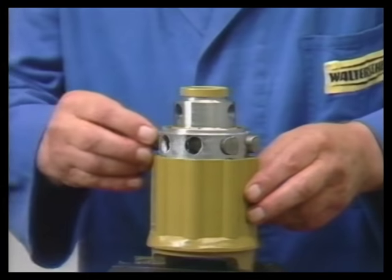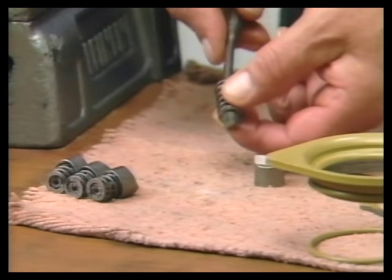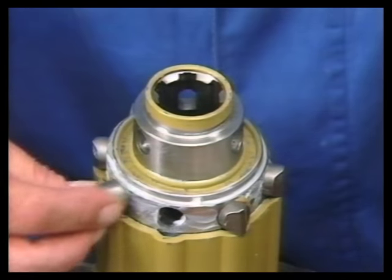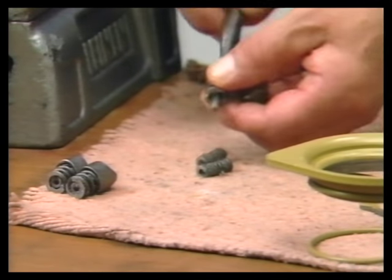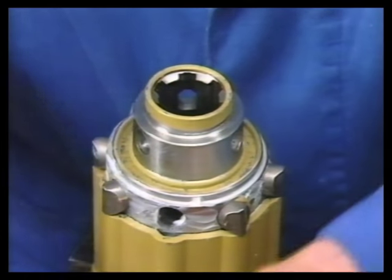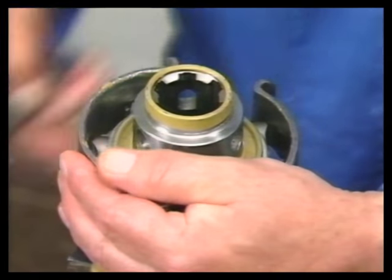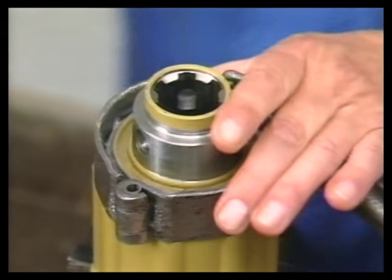The star ratchet torque may be changed by different spring pairs, by leaving out the inner spring, or by changing the number of cams per row. After the last row of cams has been inserted, the hub is pushed into the housing until contact is established.